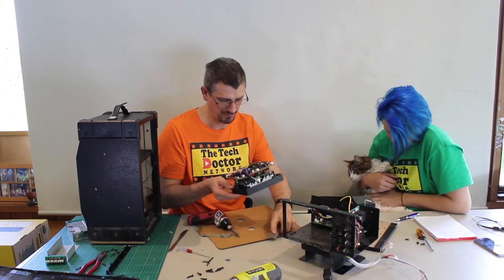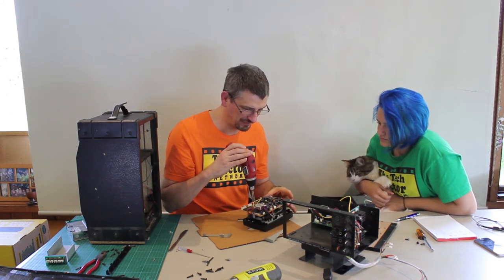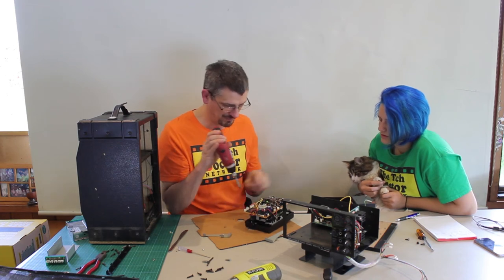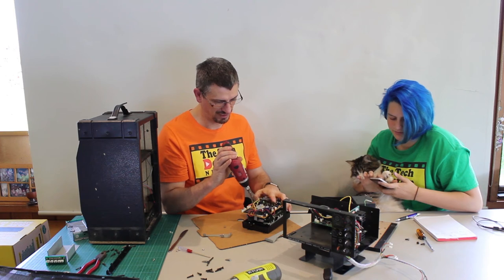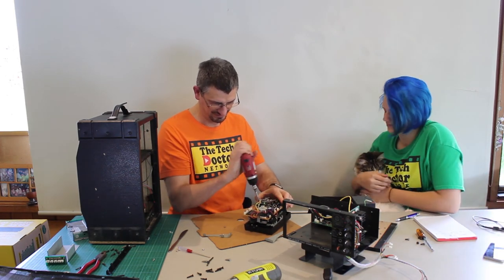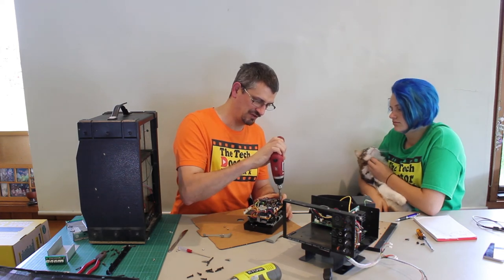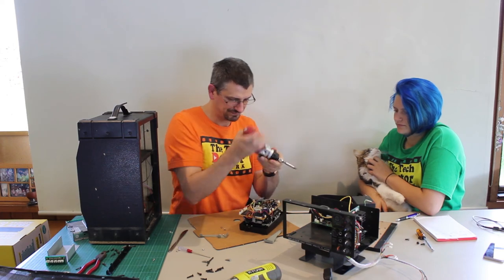Yeah, I actually want to keep them. It's also possible that this will have 5 volt on it. Why? Lots of things use 5 volt. Including tape decks? Possibly, I don't know. Are you Googling it? Yeah. No, you won't. It'll be whatever this specific board is. Yeah. It won't be a standard. What we could do is plug it in and poke around with a multimeter until we find 5 volt somewhere. Well, yeah. But I honestly think a 12 to 5 volt power supply will be easier. Yeah.